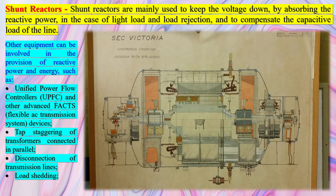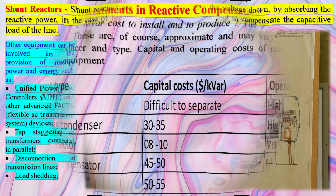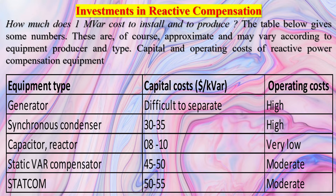In recent years, the application of Synchronous Condensers is gaining increasing attention worldwide. A Synchronous Condenser is in principle a synchronous machine without the prime mover and has advantages of improving short-circuit strength, voltage regulation, and system inertia. This helps enhance system stability, facilitates system protection, and can improve the operations of converters.